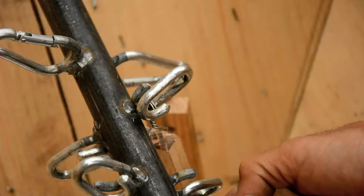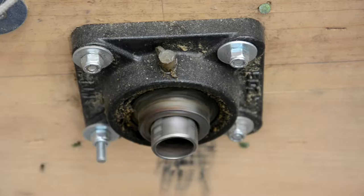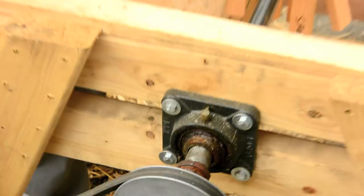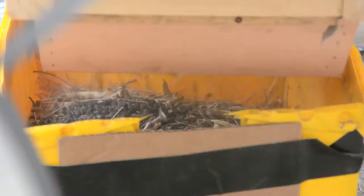The shaft is just a piece of three-quarter inch black gas pipe. The pillow block bearings on either side are the right inside diameter for the outside diameter of regular three-quarter inch pipe. Three-quarter inch pipe is great for a couple reasons: it's dirt cheap, and it wobbles a little bit, which is actually good for the action of the thresher because at the speeds we turn it, the wobbling shakes everything — shakes the seeds down and shakes the plant material up so that it gets hit by the flails again.